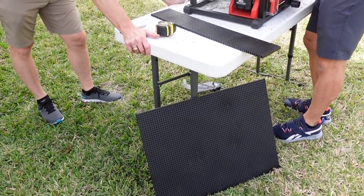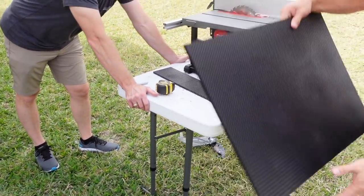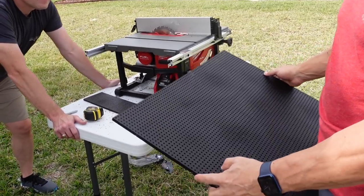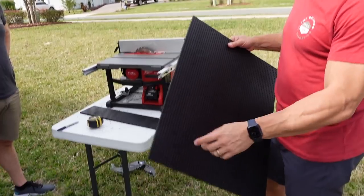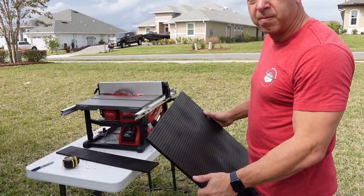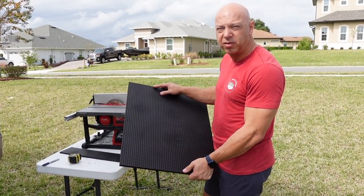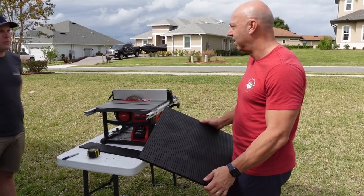What's going on? Why do we have 2 cuts on this? Because it needed to be adjusted a little bit. So I cut the side to side, front to back, right? Yeah. So the side to side is 26 inches, but it's still too long. You can't get it over the lip. It needs to be, because for the rails, they have the attachments. So they cut the one, our example, twice? Possibly, or they trimmed it. So this, without any cuts, needs to be a little bit less than 26 inches wide. Got it. In order to fit the lip. 25. Because the drawer is like 26.18. It's like a saw blade width taken off, basically.